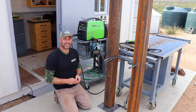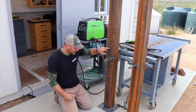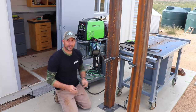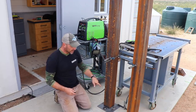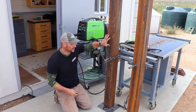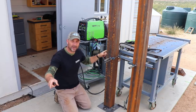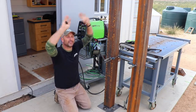At this point everything is clamped into place — I have the posts clamped onto my workbench, set in position over the base plates, and everything is ready to be welded together. Once everything is cooled down, I'll clean the rust off the posts, paint about three quarters of each one, mount them on the concrete footers, and then get ready to put the top beam on.